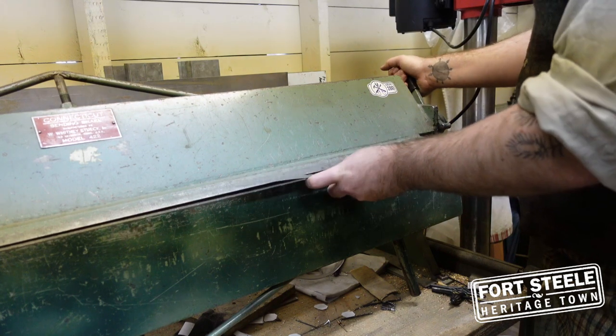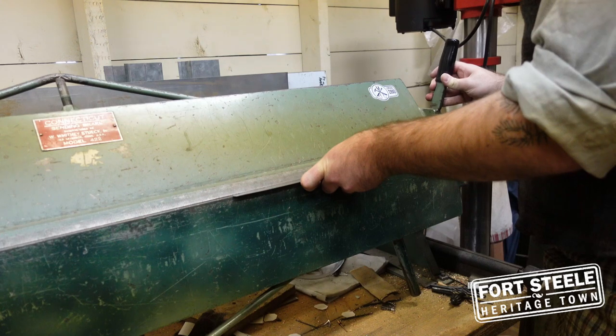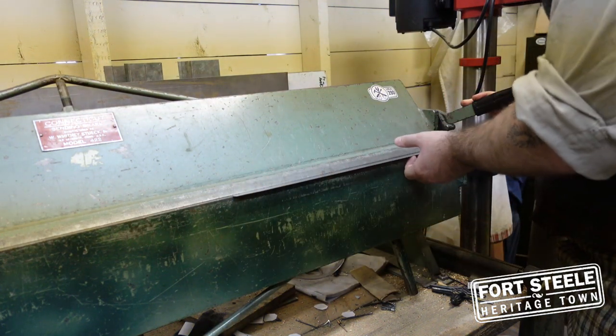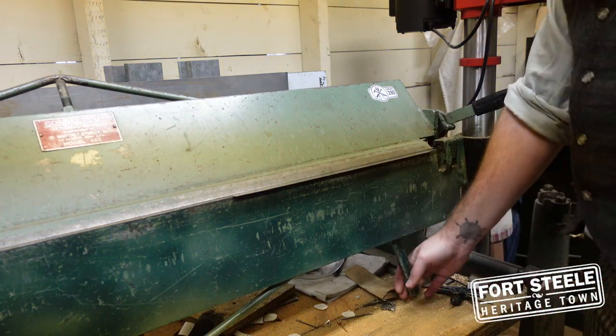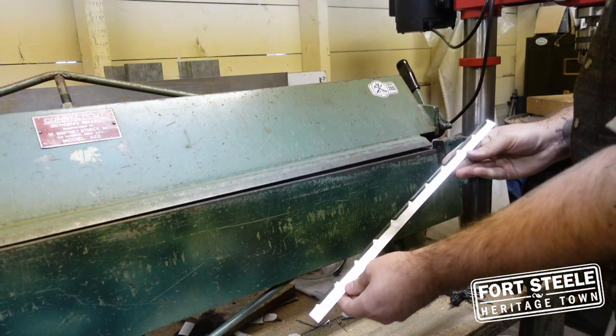For this, I'm going to lift up the brake's opening arm so I can place in my piece of tin. I'm going to line it up as best I can along that line, check and see enough material is on the outside, and with a simple flick of the wrist I'm going to bend this as far as it goes. It comes out just like that. Let's head back to the workbench now.